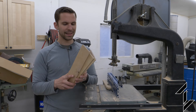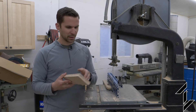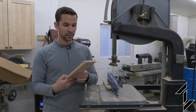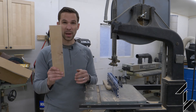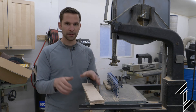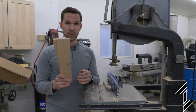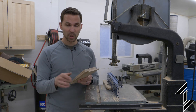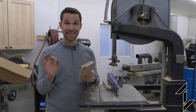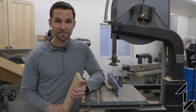Just on these two test cuts I can already tell a difference — it seems like I was almost more confident pushing it through; it didn't lag in the same way. So there you go: if you have a faster RPM motor with the same bolt pattern, or you can retrofit a different mounting position on your bandsaw, you can upgrade to a higher horsepower motor with a different RPM by just changing the pulleys. That totally works. Hope this video added value — thanks for watching.